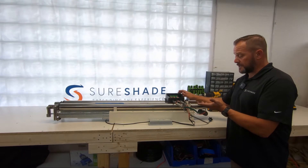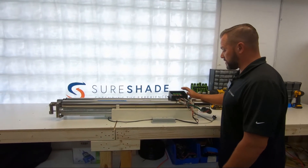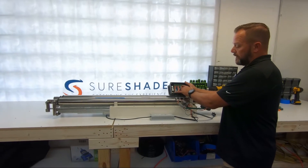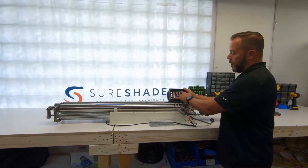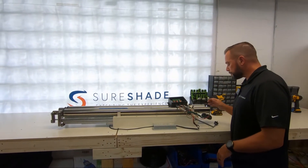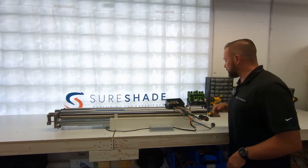The steps you want to take — as with all legacy controllers — you're going to want to check to make sure that you've got power from green to red; you want 12 volts. Or from green to orange, you want 12 volts. That means you've got power to your motherboard and power to your motors.